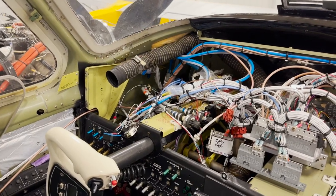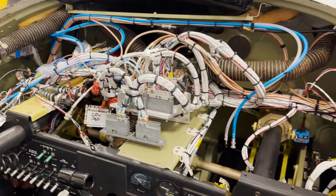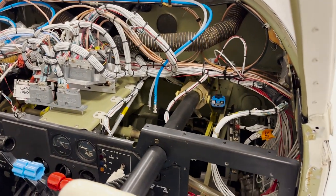In order to access the inside of the upper hinge, we had to remove the entire panel, which is okay because we have to cut a new panel anyway. As I said in video one, we were getting rid of the Garmin G5 standby instrument and putting in a Garmin GI275.